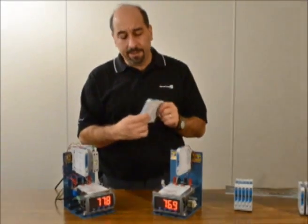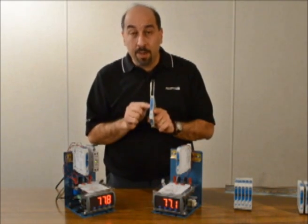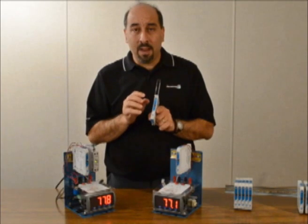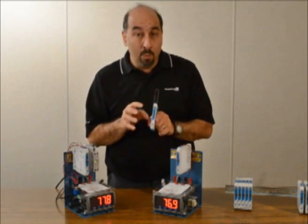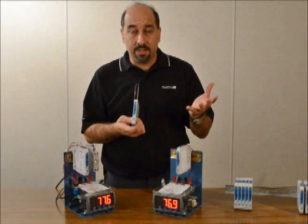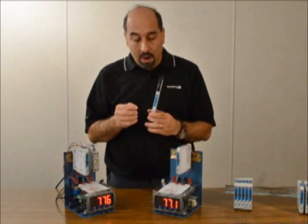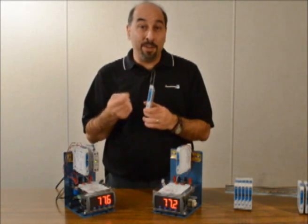Moving on to PC interface. Off the front, if you open the plastic cover, you have a USB port. These are USB configured with your Windows-based PC. There are no dip switches or jumpers to set. The operating systems supported today are Windows XP, Vista, Windows 7, and Windows 8.